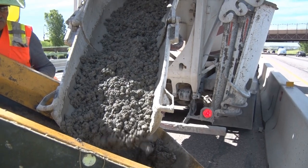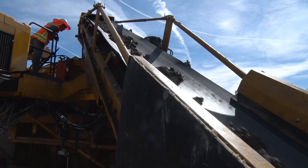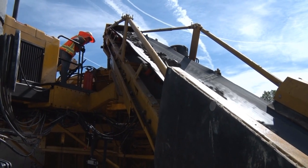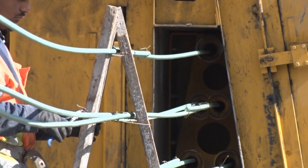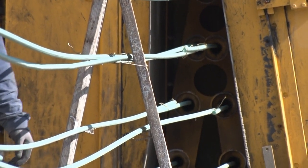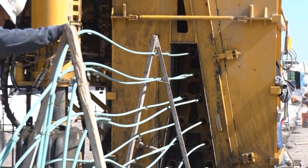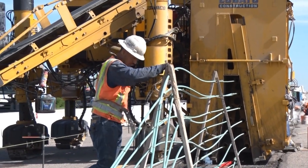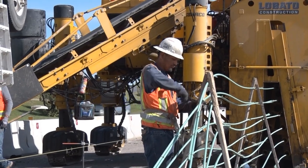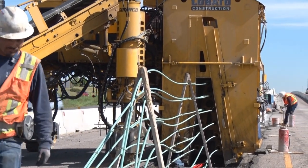That comes back to the experience with the guys — they understand what slump they've got to pour with. If that slump is too wet, they'll let the truck sit a while or call dispatch to get it corrected. There are 11 horizontals in that glare screen concrete, so you have to keep feeding rebar into the machine and keep it propped up. It can't be sloughing, because it tries to pull inside the barrier. We're good about staging and propping up the rebar, and we have one guy standing there the whole time watching it go in and making sure the bars don't catch when they're spliced.